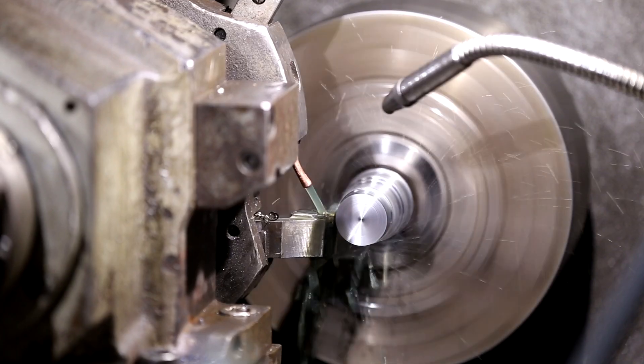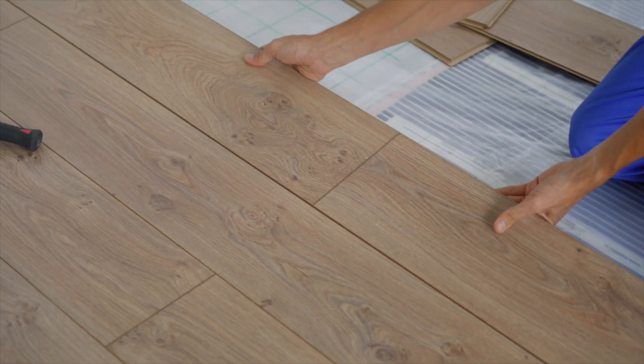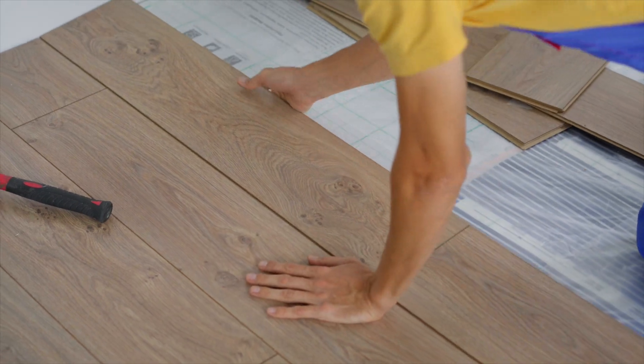Here are a few things you can do to prevent vibrations from becoming a problem. One, don't put your lab space near vibrating equipment like lathes or mills. Two, install your lab in a space with a concrete slab — avoid putting your lab anywhere but the base floor of your building. And three, don't use any type of flooring that will transfer footstep displacement to the measurement equipment when walking by.